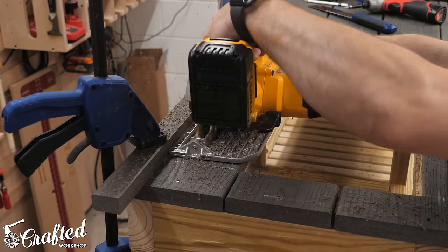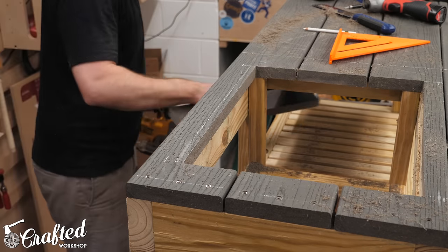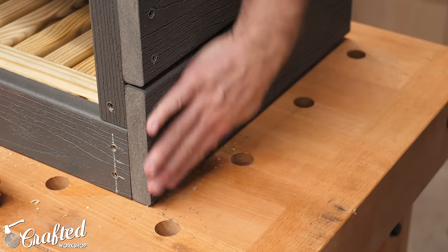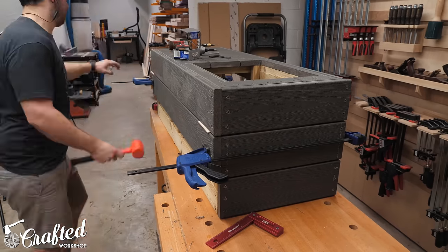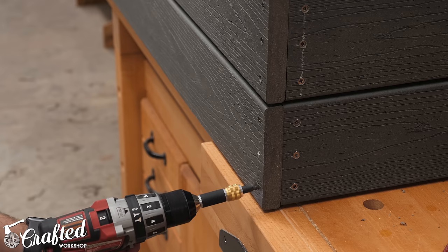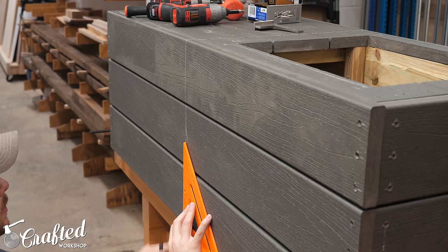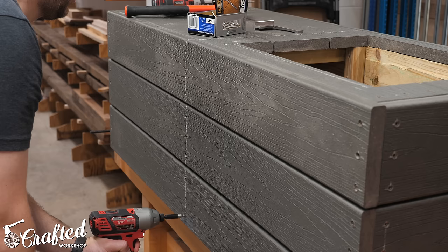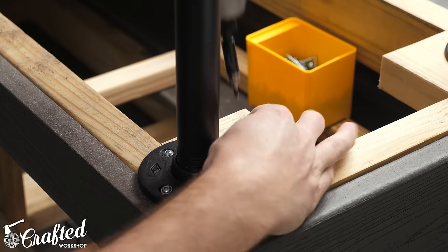Case in point, the other side cut perfectly, and the jigsaw had no trouble completing the corner cuts. After finishing the cutout, I test fit the cooler, and it fit great — it was a little bit oversized, but that's fine. With the cutout done, I could add the rest of the exterior boards, starting with the sides. Once the sides were attached, I could attach the last of the exterior boards — the front pieces. These run the full length of the patio cooler, covering that end grain on the side pieces and providing a super clean look to the front. After attaching the boards at each end, I also marked a line down the center and added a row of screws there as well. With all the exterior boards added, I flipped the top over, set the base in place, centered it, and added inch-and-a-quarter panhead screws to attach it.